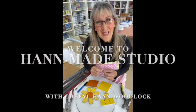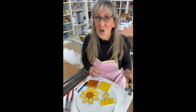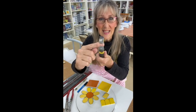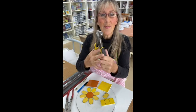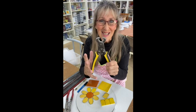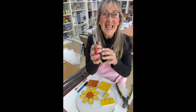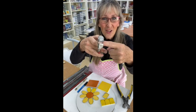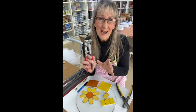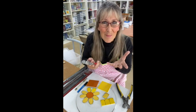The tools you're going to be needing today — I'm going to keep really simple for this project. You're going to need your straight edge tile nippers. These are compound nippers — they've got a double hinge. They make it a lot easier to cut. But if you don't have that, you can buy these straight edge ones — they are a single hinge. They make cutting porcelain a little bit more difficult, but if you've got strength in the hands it can be done.